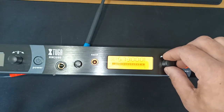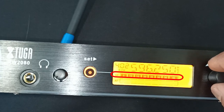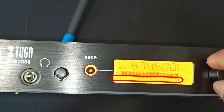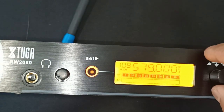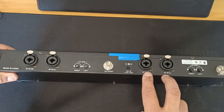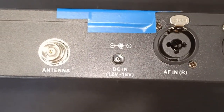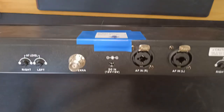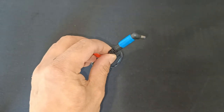Just make sure your transmitter frequency is the same on your receivers. The front screen also displays the radio frequency output bar going to your receivers, which you can lower using the knobs on the back of the transmitter. There is also another bar that indicates the audio signal coming into the transmitter, which you can adjust from the source of the audio signal — you want to make sure that the input signal is not peaking. On the back you'll see an XLR and jack combo stereo inputs for both channel 1 and 2, as well as the radio frequency output volume knobs. The transmitter requires a centre positive connector, which is why I have a white sticker on the top to remind me and anyone else using it, because most of the gear we use is centre negative. I had to purchase a separate power adapter because the one supplied is not compatible here in New Zealand.